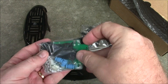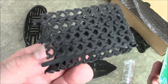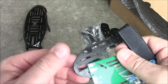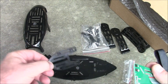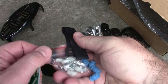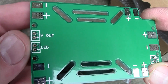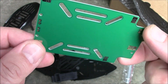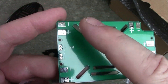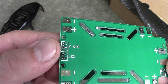I'm just going to tear this open — and there's a strap to hold your battery on. It comes with 4 rip-wrap straps for your ESCs. And then here's your camera mount and your anti-vibration top plate for your Mobius or GoPro or just your recording camera. And the little rubber standoffs. This is the power distribution board — it looks like it has voltage out and LEDs in here, with no voltage reducers on it, so whatever you put in is what's going to go out of all the points.